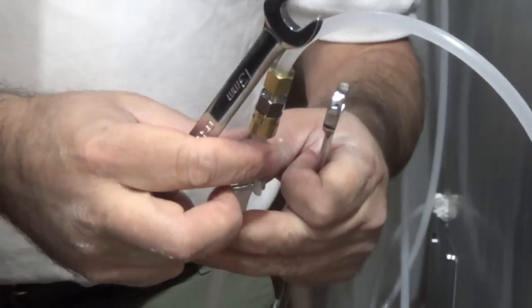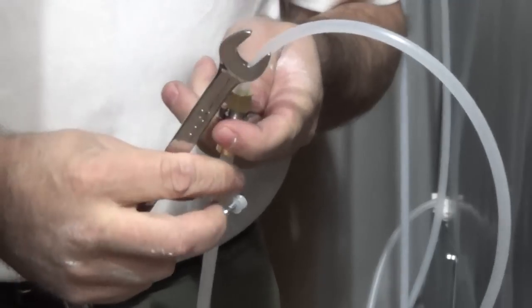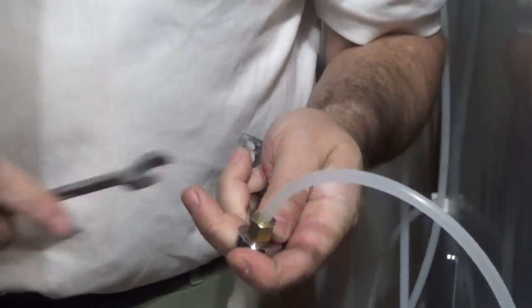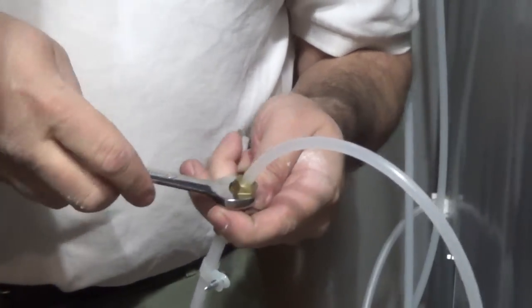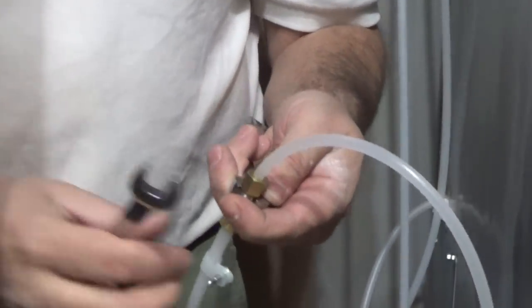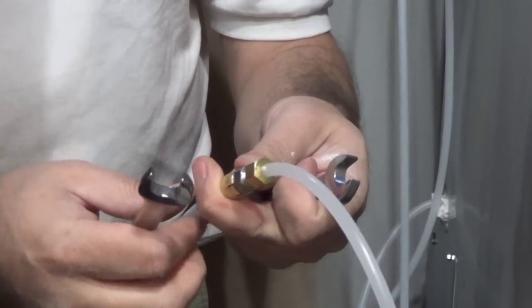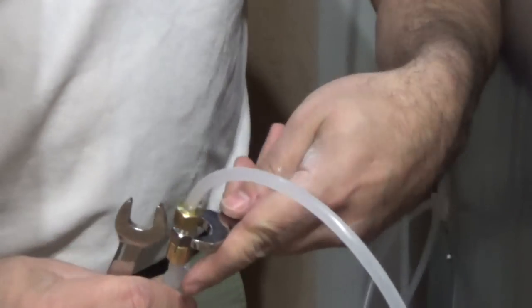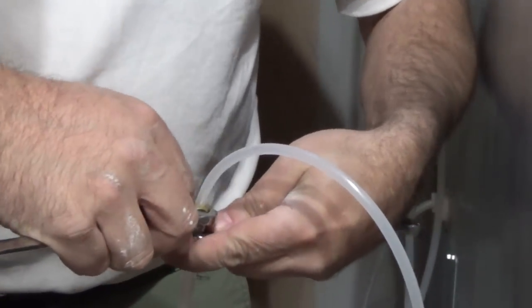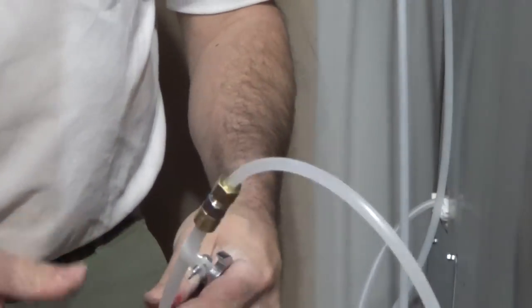I brought it out to a better working angle and it seems to have worked a lot better. Another thing I did was notice I'd put the copper compression sleeve on the wall side — I read the instructions again and they suggested putting the plastic one on the wall side, so I swapped them out. Put the copper one on the fridge side and it seems to have a pretty good fit. Just going to give it one last squeeze, then I'll open the valve up and hopefully it doesn't leak.